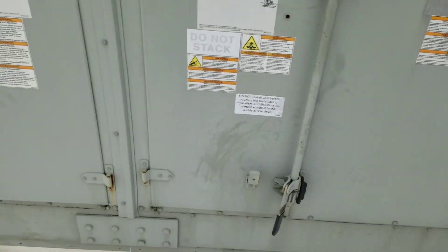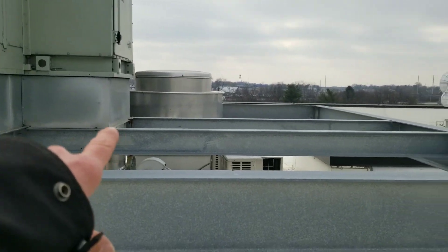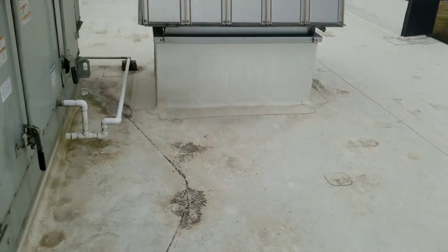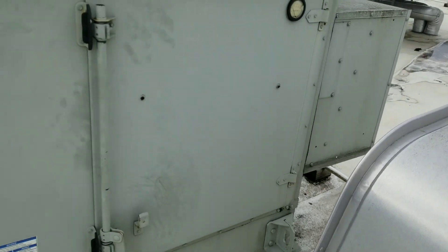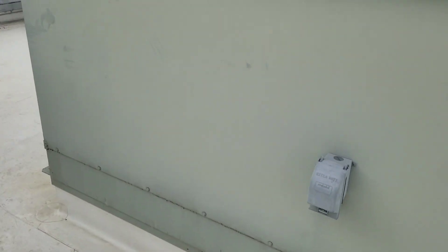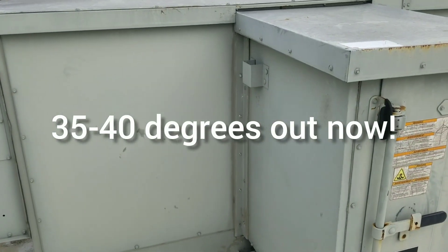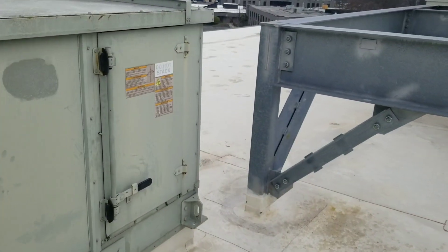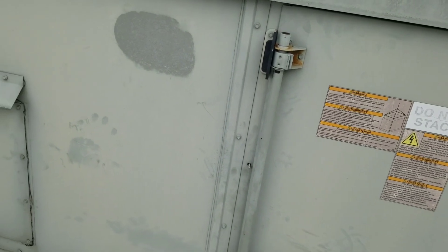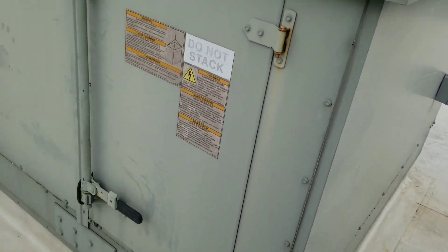I don't know why we're not just using the economizer to do that. I've got actuators in the ceiling, and two other air handlers that have exhaust fans tied into them to maintain building pressure. I'm going to crawl into that little bitty space and see if I can get the damper actuator linkage adjusted. It looks like it's supposed to be closed — it's just cracked open a little bit, probably been like that forever. With that extremely cold night, drawing that little bit of air in, we probably did hit our low limit. The unit's been running normally besides the low temperatures.